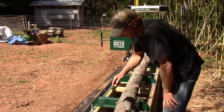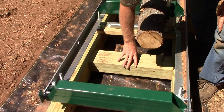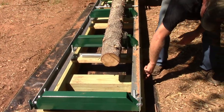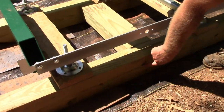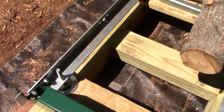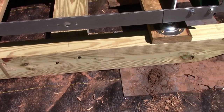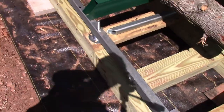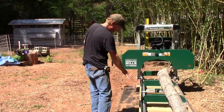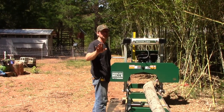And then I took the excess, because this was 16 feet and I only needed about 14 feet, I took the excess and put that big brace through here and, you know, like I was saying, use those Timberlock bolts to drill all the way in to hold that into place real good to get it real good and sturdy. Then of course, once I got it up here, played around and leveled as much as I could to get all the frame and everything just great level. I really took my time this time doing it, guys, so should come out a lot better.